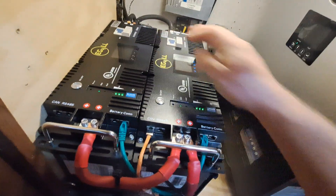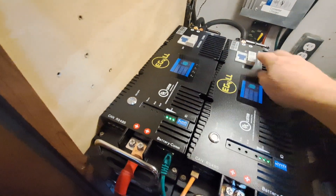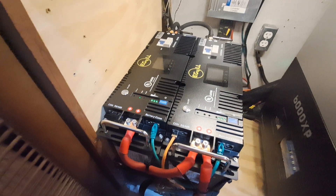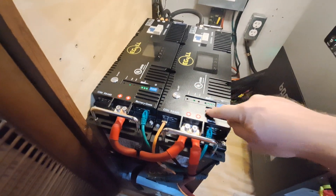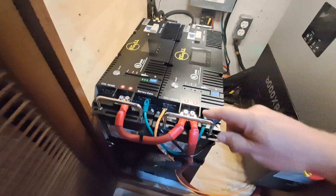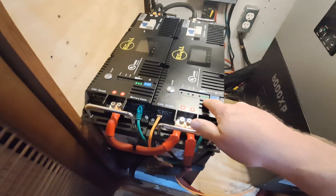There are a couple of displays that let you know the state of charge of the batteries and what the current is. You can also toggle through to see the temperature of each individual cell. These are circuit breakers here for the batteries, and what you do to start or turn the batteries on is use the on/off switch — you'll turn that on, and once it's powered up you turn on your circuit breaker, which then applies the voltage to your terminals. As you can see there are state of charge lights there.